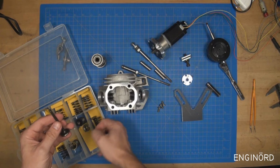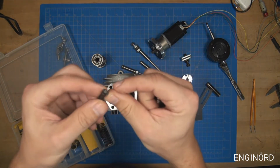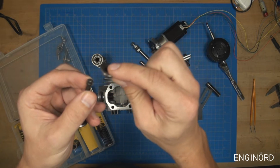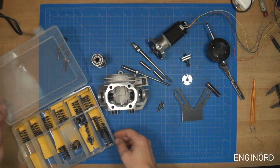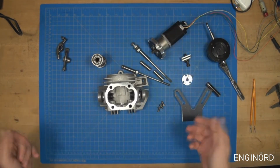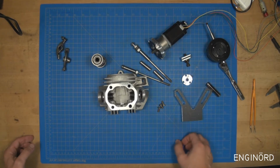So there's a valve and there are these two locks. Okay, so the little locks go in like so, and then there's this spring retainer that basically wedges in, and everything has tolerances. So when you put the whole thing together, it's gonna have a large spread as far as dimensions. I realized that, and I didn't like the numbers, so I decided to go back and maybe come up with a better system.